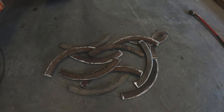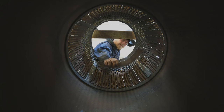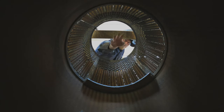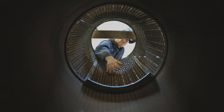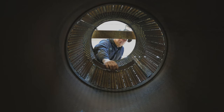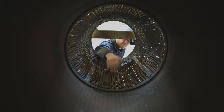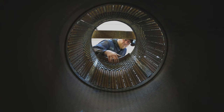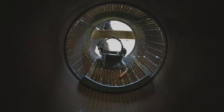Now let's put some stopper rings inside of the barrel. We'll be installing three sets of rings. The first set will prevent water from rushing from the hopper onto the screens and out the back of the barrel. The second set will divide the two classifying screens. The last set will prevent any material from rushing over the one-inch screen and out the tailing chute.